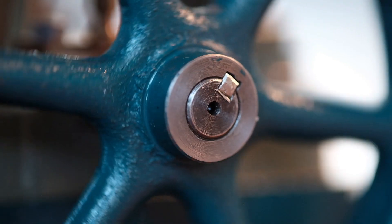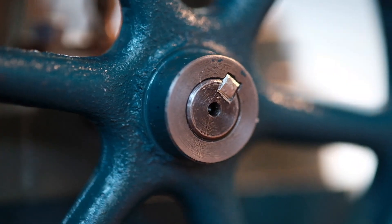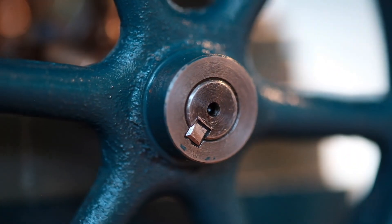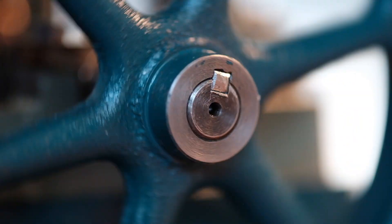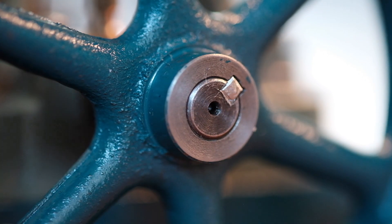That's why you don't see real flywheels attached to shafts with a set screw. What they use is a key, and this little steam engine has a keyed shaft, which is one of the things that makes it practical and more realistic. In this video, I wanted to talk about the process of putting flywheels on small steam engines with keyed shafts.